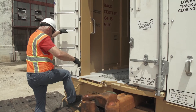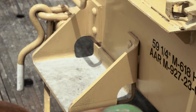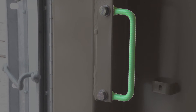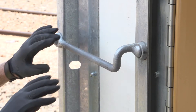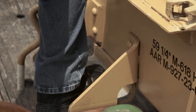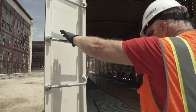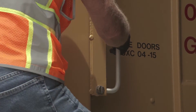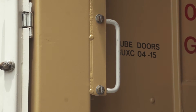To get onto the decks of the Multimax, you only need to use the end sill step, the door ladder, and the courtesy hand holes just inside the door of the car. Grab the most convenient door ladder rung, then step onto the end sill step. Mount and climb the ladder until you can easily move onto the deck surface. Use the courtesy hand hole to ease your passage onto the deck.